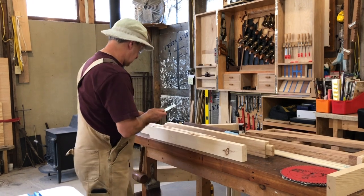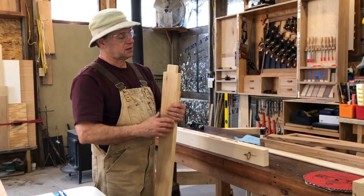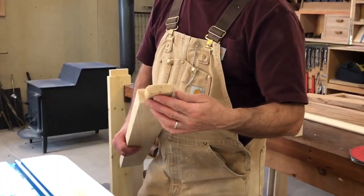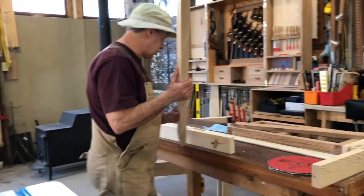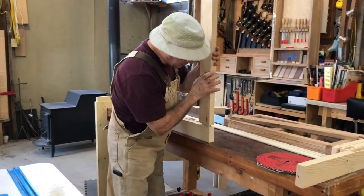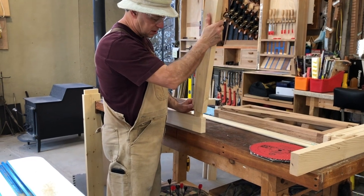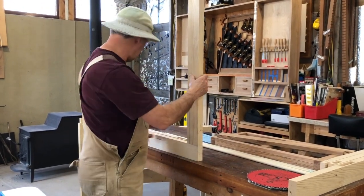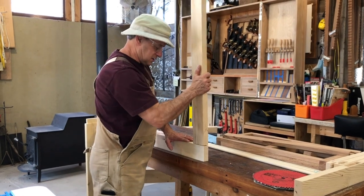Then I was able to come back and cut my tenons on my stiles. I'll demonstrate in a moment how I cut those — nice square edges — and then I rounded them off just slightly and chamfered the edges with a plane, so now they're ready to go in. It doesn't really matter which one because they fit pretty good. You want to make sure that you get a nice snug fit when you're done — that's the whole point. That will be the top railing, and the one I'm working on will be the middle or bottom rail — a two by six.